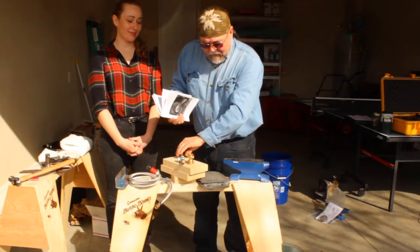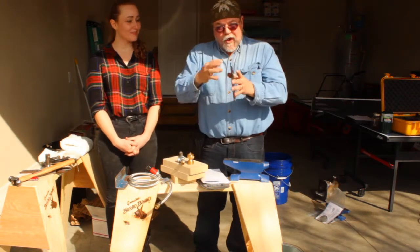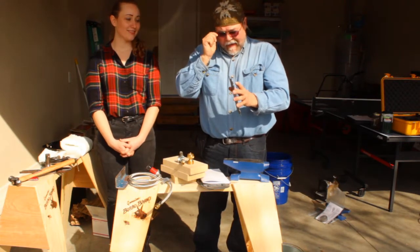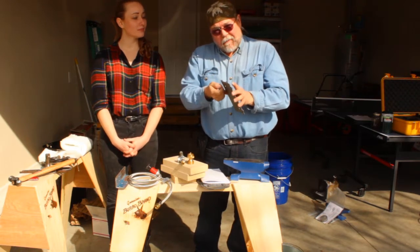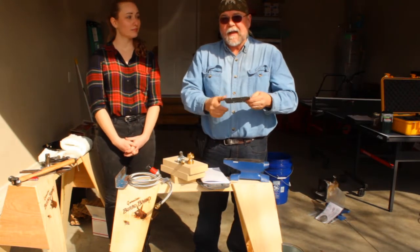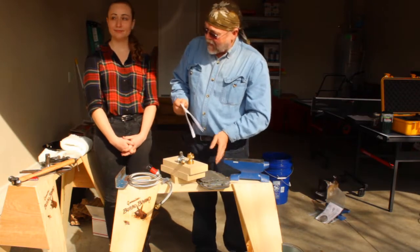The steeligami kits that we put together are designed to be assembled with no additional hardware. You fold the parts up correctly, assemble them together, and then use a hammer to fold the tabs over. If you accidentally fold the tab the wrong way and then bend it back over, you could damage the tab. So we want to make sure that we read the instructions and go through the process correctly so that we don't end up breaking off any of your tabs.